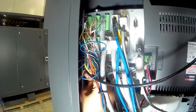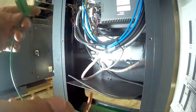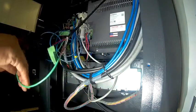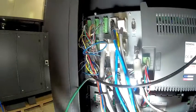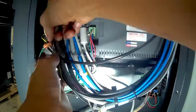Now I can move on to my ground, which is going to be this silver wire hanging off to the side. I wrapped it together with another wire so they can reach my ground lug. I'll loosen the lug up a little bit — I always slightly bend the wire so that it curves around the lug, almost like a little candy cane. I hook it on there and make sure the ground doesn't slip off. To finalize this, I'm going to put a wire nut on my ground just to make sure it's absolutely secure. Now it should be ready to go.